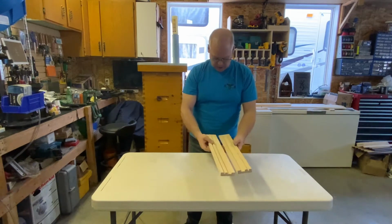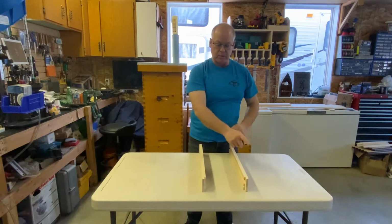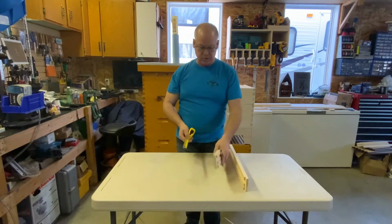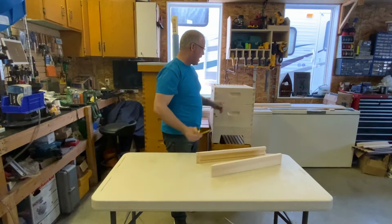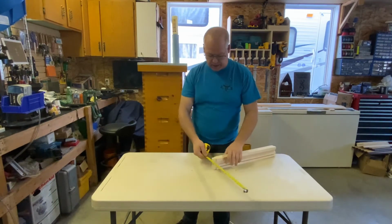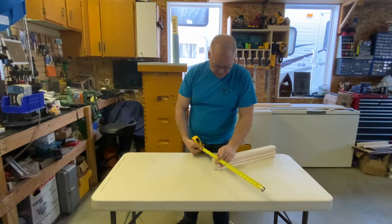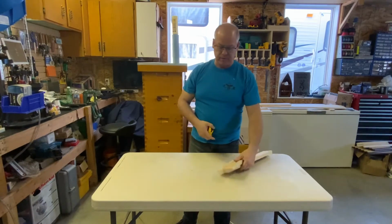All right, so we've got a marked top and our front. Now what we have to do is cut a piece from between there. As we know from last time, I've left a little bit more on this one, so we're always going to want to double check. We know from our box, we're 16.5 inches wide. If you weren't very good at math, you could go 16.5 to the edge, which is going to tell you to cut our board 15 5/8. But we'll go cut a board now, 15 5/8.